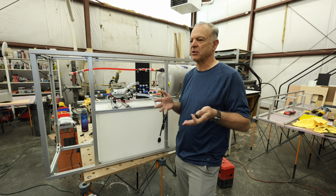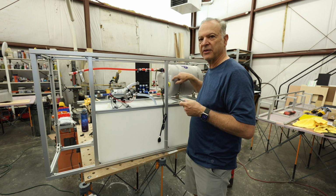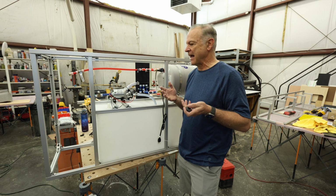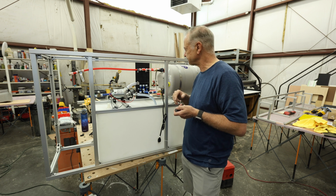But if you do have an indoor shower, that is something that's really nice, that you can tap into. The antifreeze from the vehicle just circulates through this and heats the water while you're driving, and then it'll keep it hot, like I said, for a day at least. And so you're going to have pretty much endless hot water without ever having to run your electrical system if you go with that application.